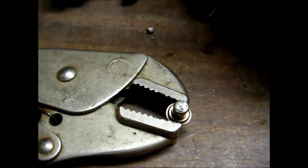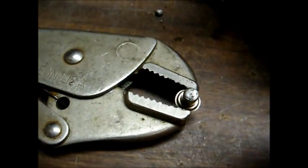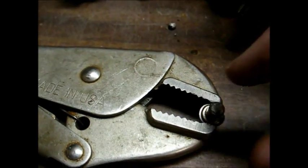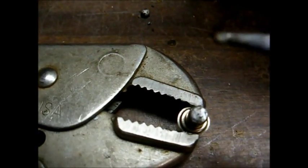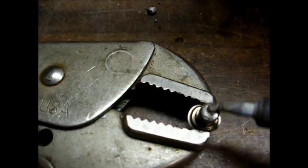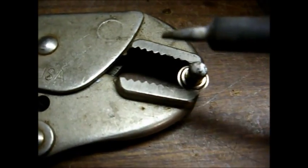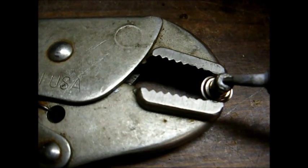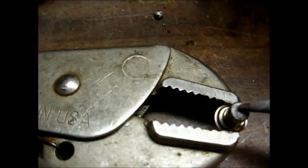First, you need to prepare the tube cap to be remounted to the vacuum tube, and as you can see, I have it mounted in a pair of vice grip pliers. Don't squeeze too tight or you might destroy the tube cap. You need to heat up this solder here — and yeah, my solder and iron tip looks kind of rough — and use either a solder vacuum pump or desoldering braid to remove the molten solder.